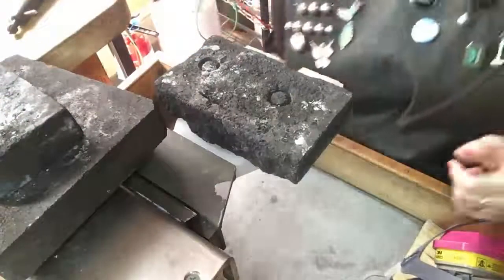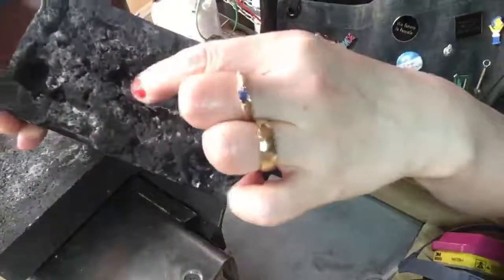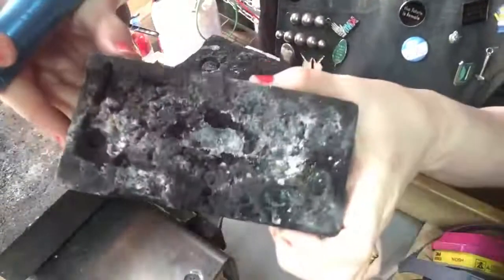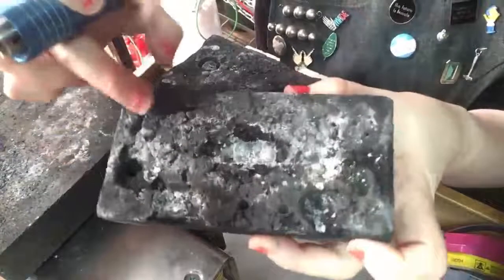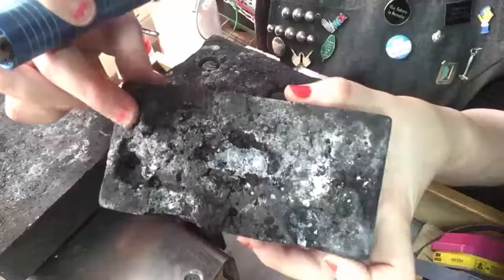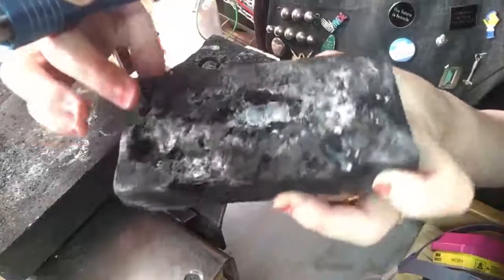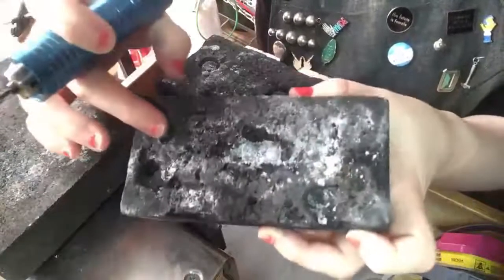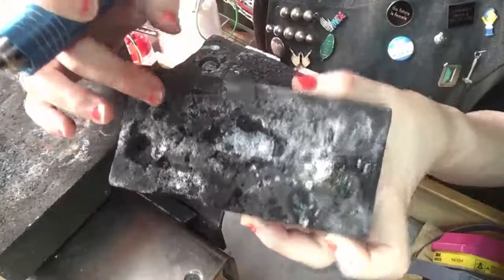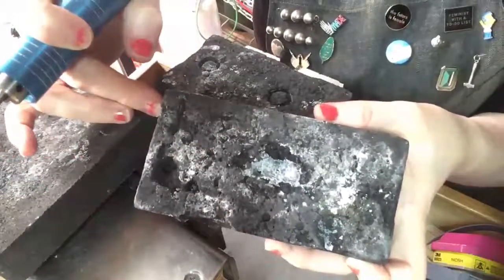What you can do to modify it is actually make charcoal into basically a little crucible — that's what this divot is here in this charcoal block. You can see I've modified it over the years for all kinds of things. I've made little channels — this was a really handy way to hold a super complicated piece where I needed part of it to not get oxidized and stay silver. It created a reducing atmosphere, reducing the oxygen, so I could solder it up on top while keeping it protected down below.